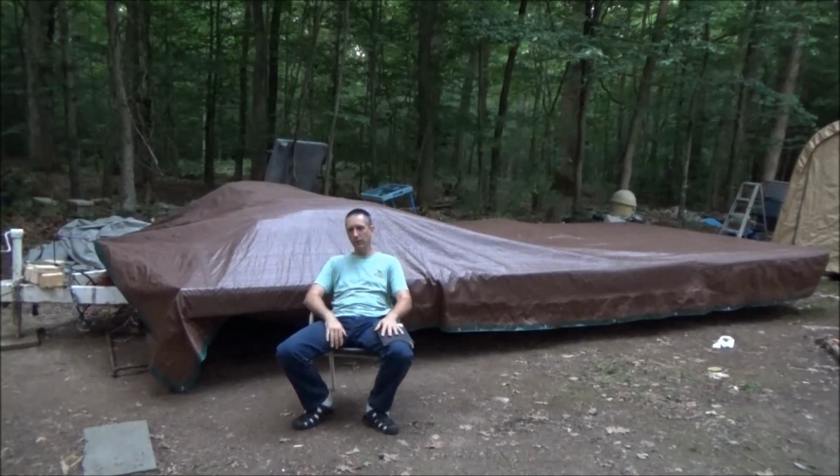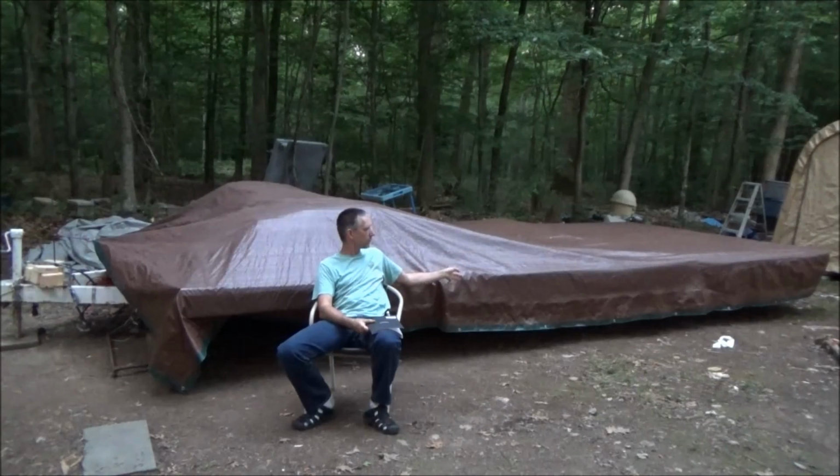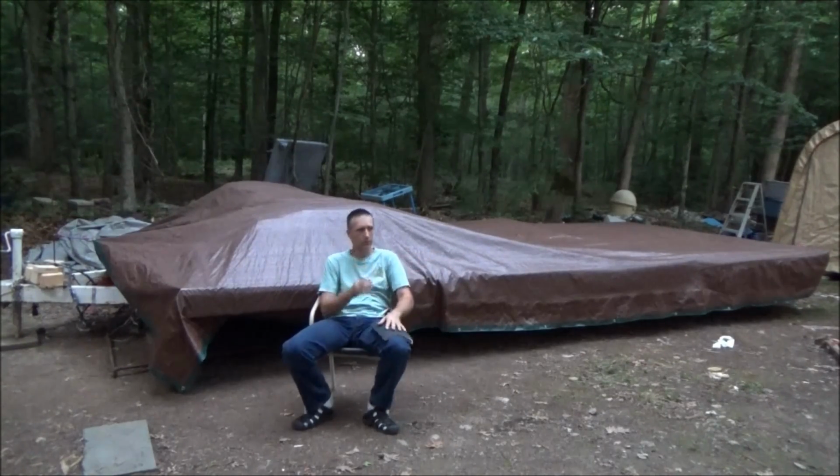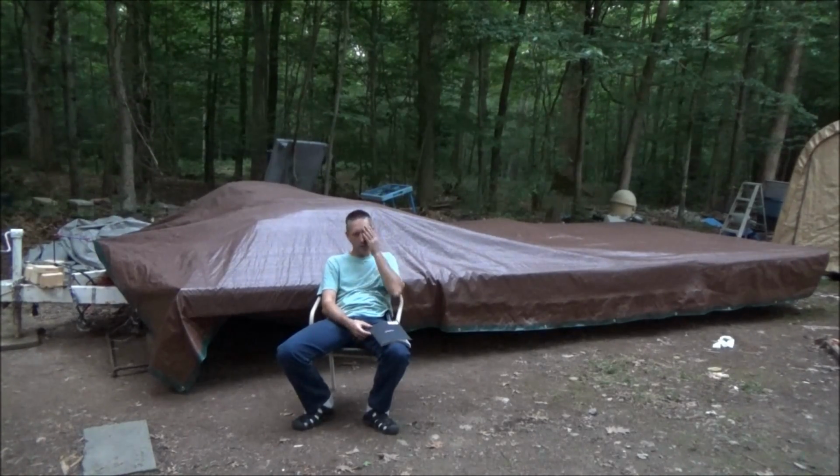If it was a subfloor, a different story. But this way, I can deal with the seams better. And I'm putting the support underneath. So far it feels really rigid and firm, so I'm happy with that. But I am going to have a solid piece of plywood sheet in the dead center where the two halves overlap, and then I'll work out from there. So that should alleviate any stress and worries that a lot of you may have on that.